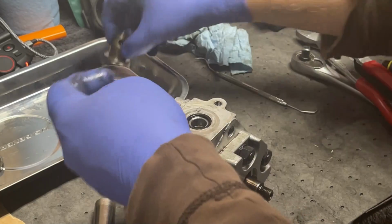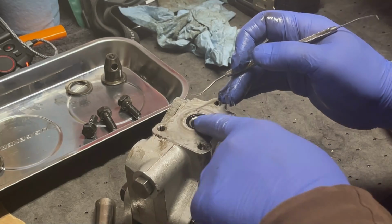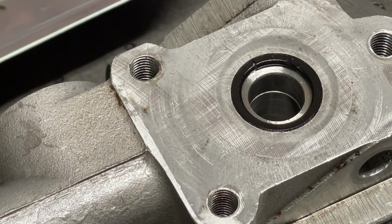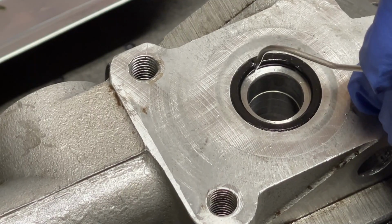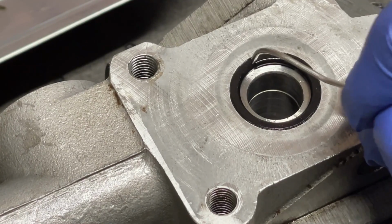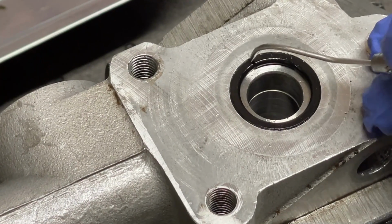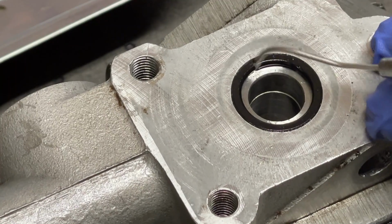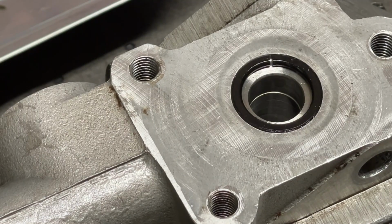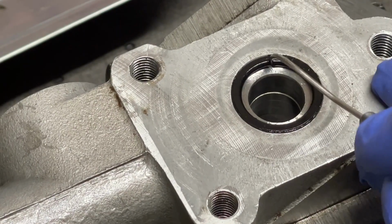Yeah. All right, set that there, and look at there, we've got an O-ring. I can't even feel it. Something I noticed while inspecting this thing, there's a break in this O-ring right there. It's broken completely in two. I am so glad I took this thing apart. I can see shiny metal if I can move it around. See it? There you go. There's a perfect view for you. Right there, the O-ring is broken in half. Let's dry rod it.